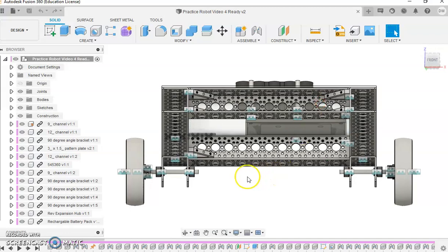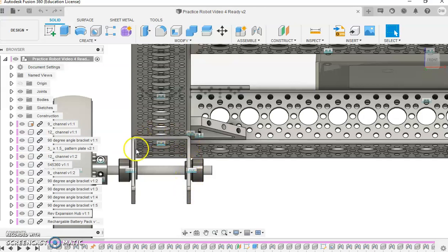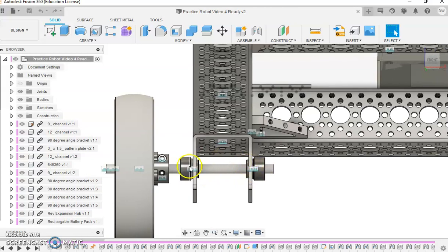To get started, we're going to start with the chain drive motor. The starting setup is going to be very similar to what you've already done. You're going to put on this little U-channel first, put your axle through it, offset the axle 0.5 inches to the inside - same as before. Put the bearings in and put one shaft collar on this side. That's where the similarities are going to stop, and after that we'll do things a little differently.